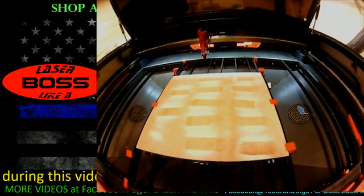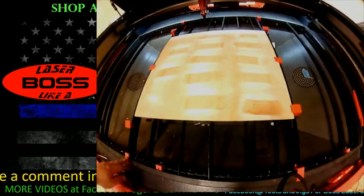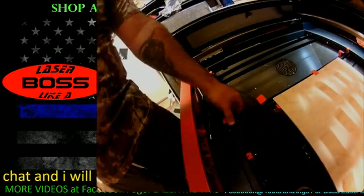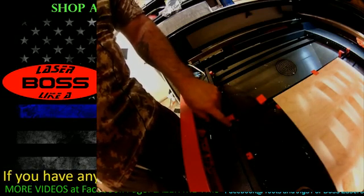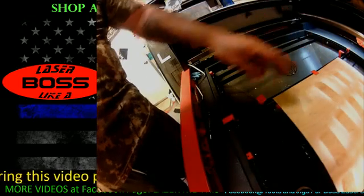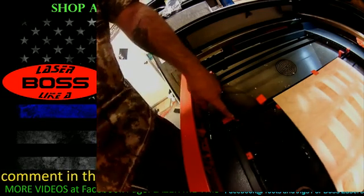That is that. If you have any questions, let me know. I know I went over this pretty quick. But just to recap, your blade clamps right here. When you're installing these on your bed, I should have said this before we started, if your knife blades are not flat or close to flat on your bed, and there should be about a millimeter, which accounts for the ruler on the other side of the bed, so you should feel a little bit of a lip right there on this side. If your blades aren't like that, and you try to force these on, you will break them.